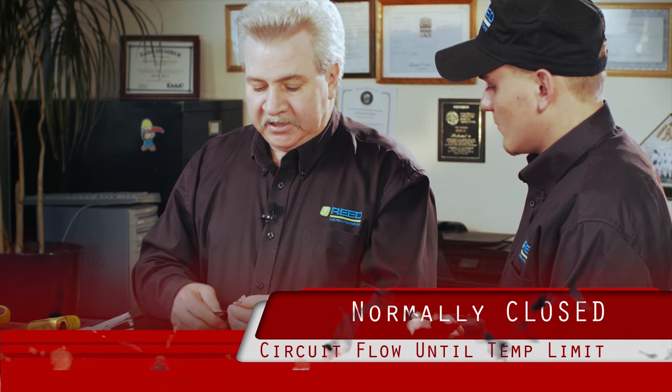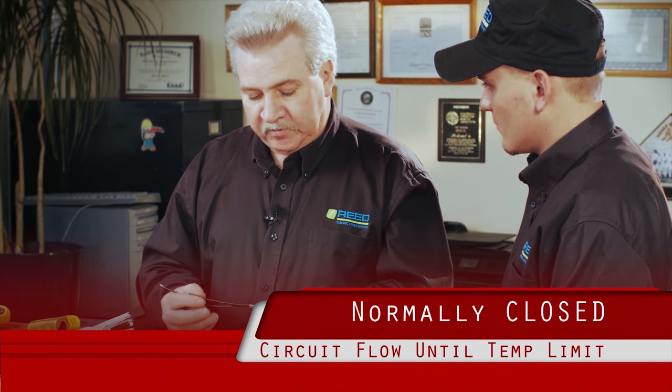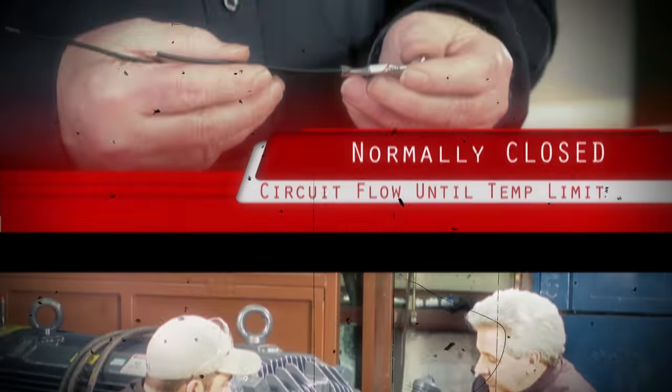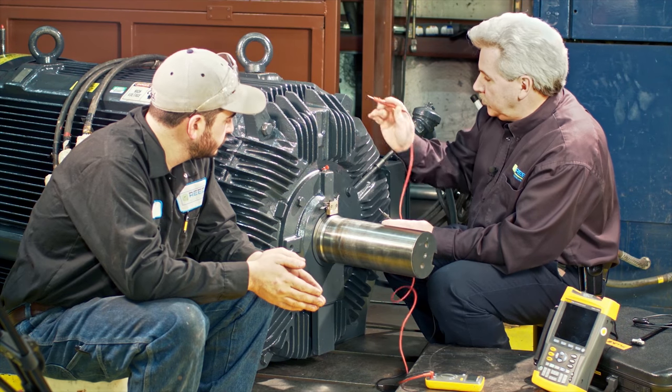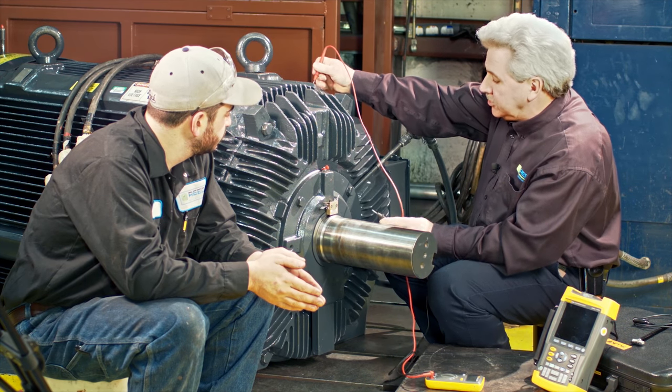These come in a normally closed or a normally open position. The idea of using the ohm meter right now is to make sure that we've got a good ground. You can ground with one lead any place, like on the nameplate, as long as it's got a path